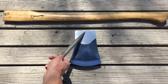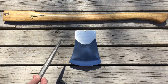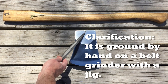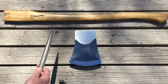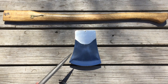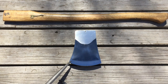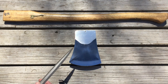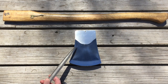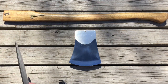It's fun. These kinds of chisel grinds are done by jigs — you have to use a jig. It's hand ground but not done by hand. That's the pivot point for the jig right there; you'll see those on racing axes. This is a 20-degree chisel grind, kind of a work grind for race axes. Measuring it, it's about 17 millimeters in the middle, about 14 on the ends — just the shape of the head, not the same as a racing axe. Ethan Goss up there put phantom bevels on it and lightened it up a little bit; it's just above four pounds.